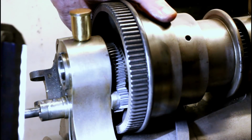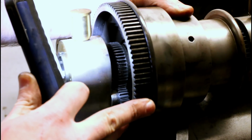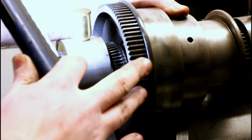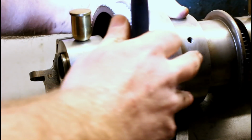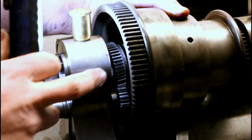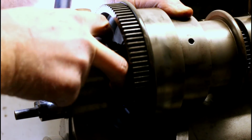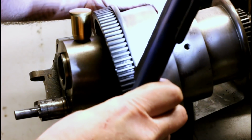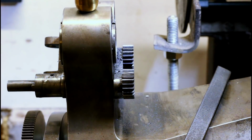Inside the back of the cone pulley here, you've got the tumble reverse arrangement that'll be keeping the whole pulley assembly from falling directly out. So you have to kind of tip it and remove it, but that spindle drive gear is still hanging out in there loose, so you want to fish it out first. Carefully remove the pulley. Let's take a closer look at the bearings here.